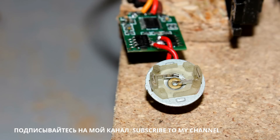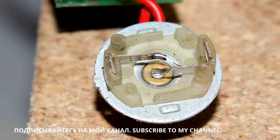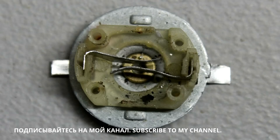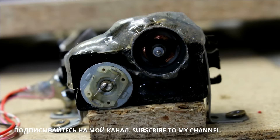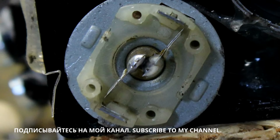The servos I am using are not very reliable — one broke while recording this video. The weak point are the brushes inside the motor. At the broken motor, the brushes deformed in such a way that the terminals were shortened, causing the servo board to smoke up. I opened the motor and cut new, more solid brushes from a tin can. The new board is from another standard servo I had in stock. After opening the second servo, I saw that the brushes of that motor were also in a very bad condition. I used some solder to stabilize the ends of the brushes, and that servo still runs fine.